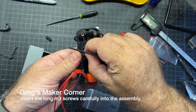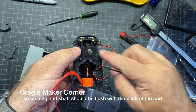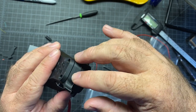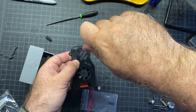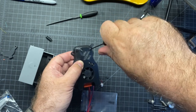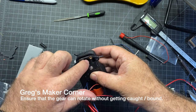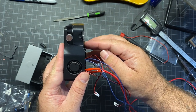After messing with it for a little bit, I got them in easily. It's just an alignment thing really, but the bearing is fitting in there just right so it looks flush. Now I'm going to insert this direct feed extruder part — it just goes right in here. Now we're going to put two M3x30s in here to tie everything together. I got my M3x30s in and I just need to tighten them down — they went in just right. They're going to lock into those heat inserts in the part in the back, so they go in pretty tight. Then I just put this spring in for the tension and that's pretty much it. Now you're supposed to check for binding — I don't really feel anything, so everything's looking good. The other thing is to make sure this shaft doesn't protrude past the face, which it doesn't.